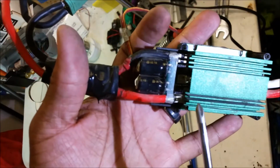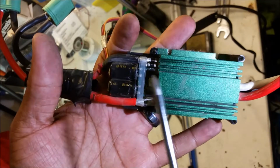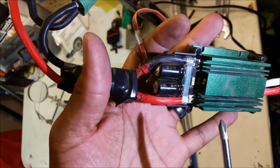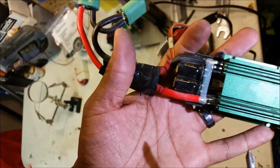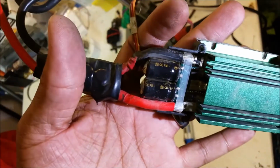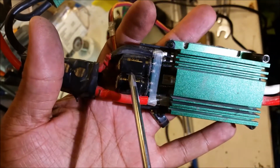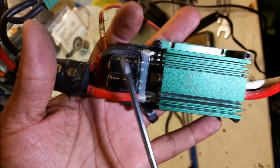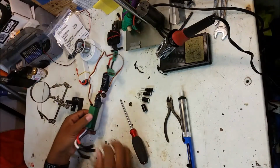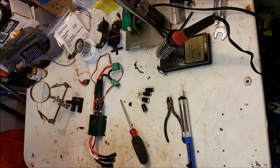Looks like they are attached to the circuit board underneath this piece of tape here, which I will try to gingerly remove. If I can't, I'm just going to rip it out. Get the light on there right. It looks pretty simple. Just got to desolder the two points and resolder the caps onto the board, making sure to get the positive and negative leads right. Since this bottom half wants to fall away, I'm just going to take it off. Don't need stuff clattering around.